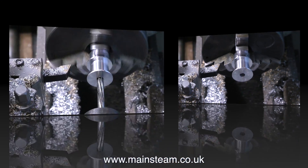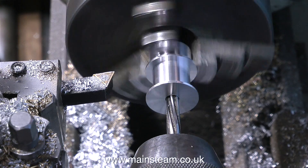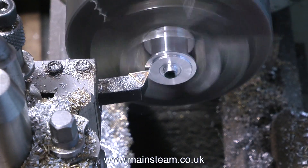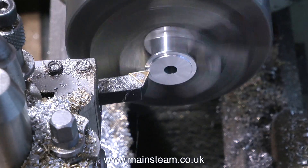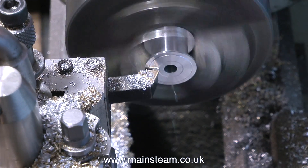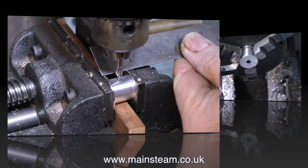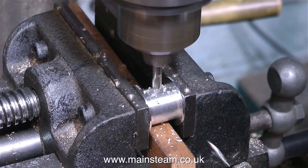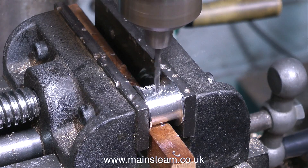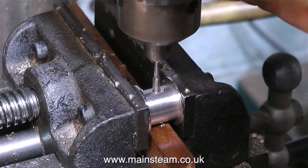The pulley has been in the chuck the whole time, so this will be a quite accurate component. First I centre drill it, then drill it with a twist drill one imperial size under a quarter of an inch — if you need to know what that is, just google imperial drill sets. After parting off the finished pulley and reversing it in the chuck, holding it lightly by the flanges, I machine off the front with very fine cuts. I then drill a hole in the centre with a centre drill, drill it with an eighth-of-an-inch diameter drill which is tapping size for 4BA, then thread it 4BA, brushing the part with white spirit as lubricant. The tapping operation shown is speeded up by 300%.